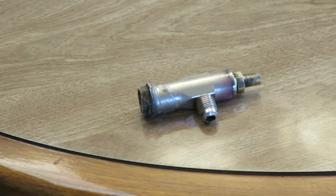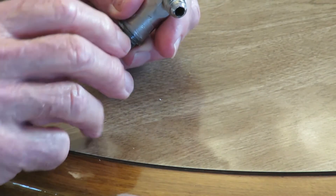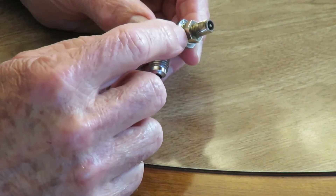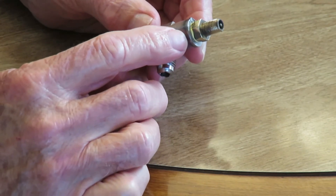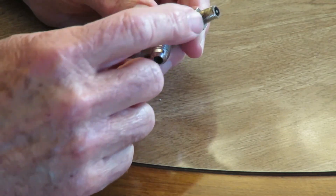After I cut it off, then I cut off the green plastic handle. After I cut that off, I drill this out with a 5/16th drill and then I tap it with a 1/8th pipe tap — that's what this Schrader valve has on it.